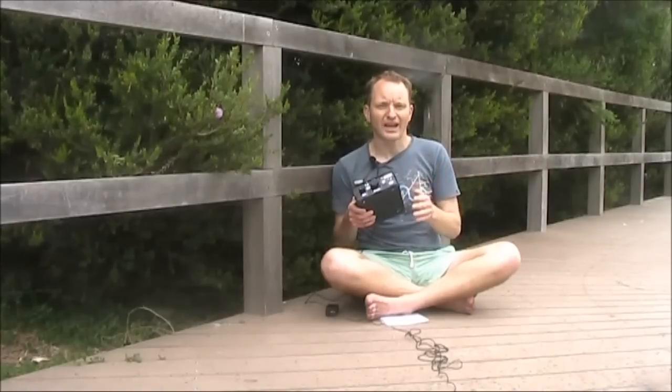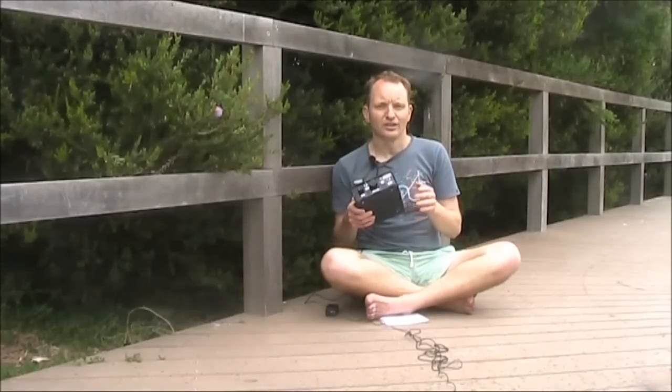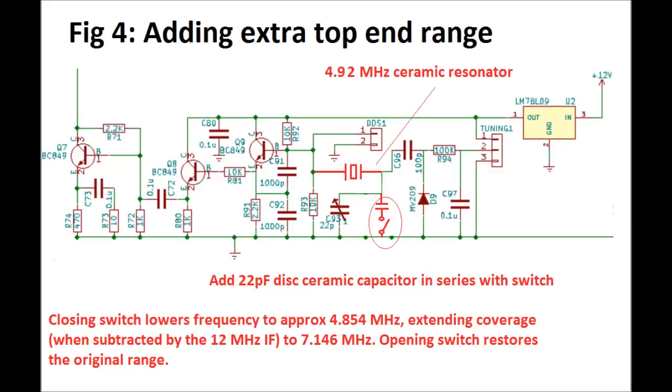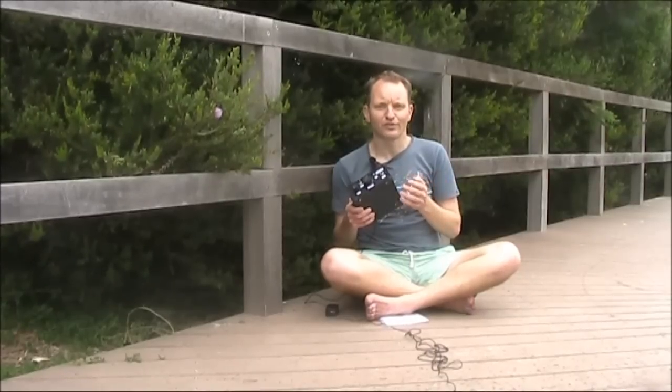That's quite good here in Australia and probably Europe, but there are times when you want somewhat higher frequencies. You'd do that by adding some capacitance again — 22 pF gives you another range, about 7.115 up to about 7.145. You add a toggle switch so you can switch between them.